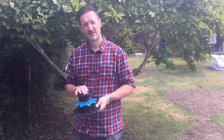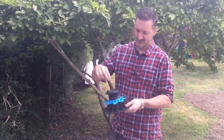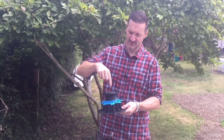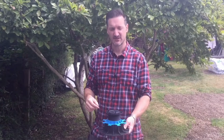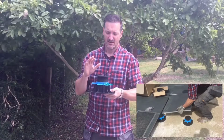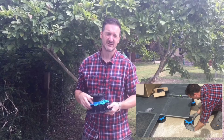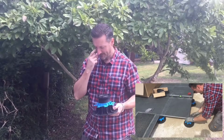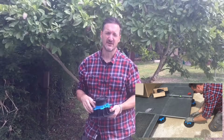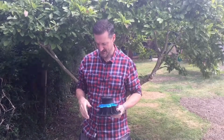The other little bit of extra work you've got to do with these, some of the systems you can put a key in and make an adjustment from the centre once the pedestal is in place. Okay, so you need to adjust the pedestal with the tile in place, with the spirit level to get your level correct. If you need to do any adjustment after that, if it's sunken for any reason, it shouldn't do, but if it has, you'll need one of these.